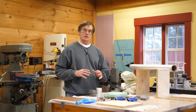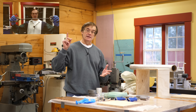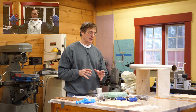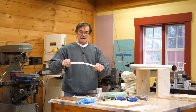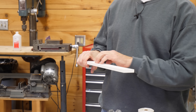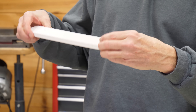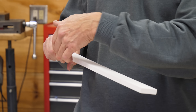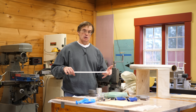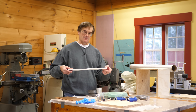E-Glass can be used structurally to create what's called a composite core sandwich. If you're interested in the physical principles and details, take a look at the video we did about a year ago on composite core construction. Simply stated, if you take a monolithic piece of material and bend or stress it, most of the stiffness and strength comes from the surface layers, while the weight comes evenly from the inner layers. So if we concentrate the stiffness and strength in the surface layers and lighten up the core, we can produce a stronger, stiffer, lighter, and potentially less expensive version of the same panel.